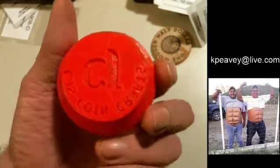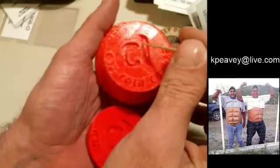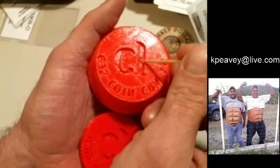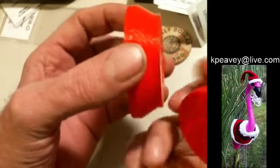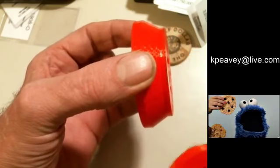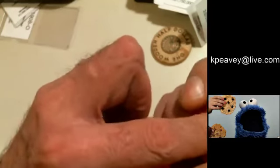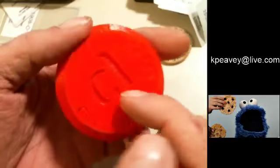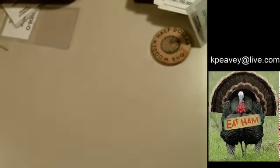That's the idea. But you can't get raised devices from a clash from the reverse die and the obverse die and have them appear on the fields, or have them appear on the devices. The fields are going to block anything. Nothing sticks up above this surface, which is going to be the field of your coin, right? And I can't get devices from here to show up in there. Impossible.